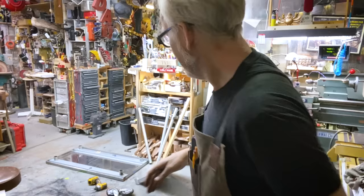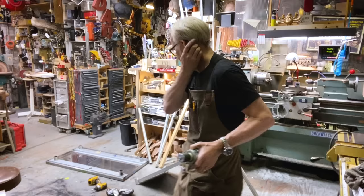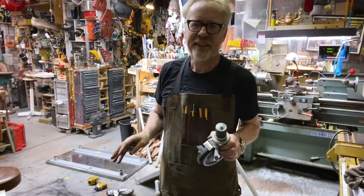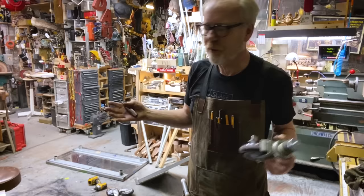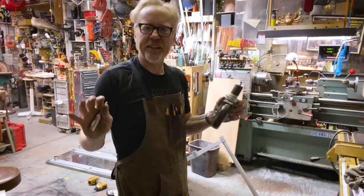Secondly, I can see that the long rails holding the tabletop together are failing, and in fact, I may just turn this tabletop here into the top of that and mount the rails right to it. But first, what I may do is actually weld this thing together, because I don't need it to be configurable. I could weld these pipes to their pipe sleeves and get a lot more rigidity. I have one more plan for rigidity, but once I've got stuff welded and I see where it's at, then we'll go from there. I'm appalled.